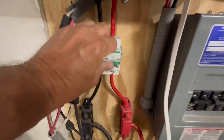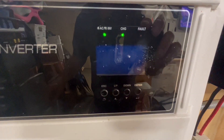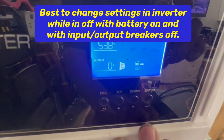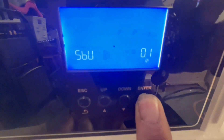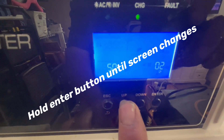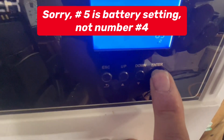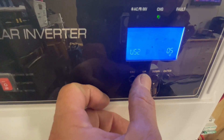It's lighting up. Flip our breaker and we should start getting some lights — there we go, the inverter's powering up. Now I already have this set up in lithium mode, but the way to set this inverter up for these server rack batteries is you go into the Enter button right here and press it until you get number one flashing. You're going to go the up button to two, three, four — four is your battery setting. Right now it's set on number five, the battery setting, and it's set on lithium. In order to get there, you press the Enter button until the LI starts flashing.